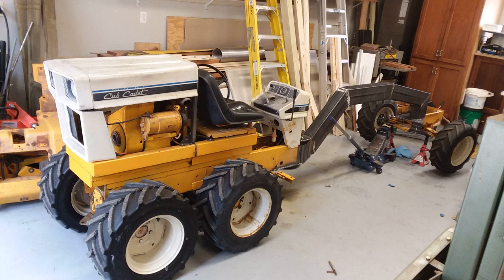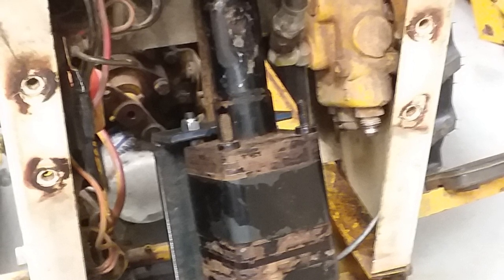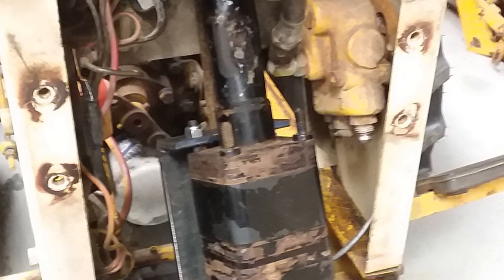Here's just another shot of the tractor — you can see how the two-by-four steel tubing frame was extended up underneath the seat, and the seat does flip forward on a normal Cub Cadet stand. Here's the power steering valve. I went back in and added some steel bracing to it because it was a little floppy. This power steering came from a later — maybe early nineties — Cub Cadet.